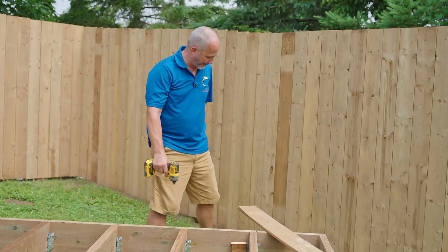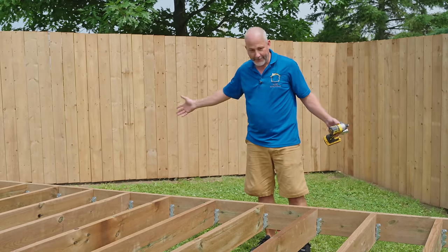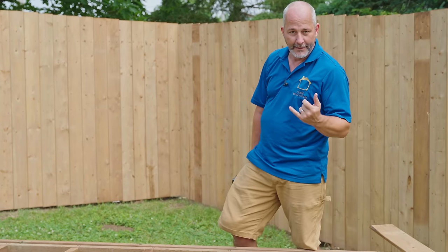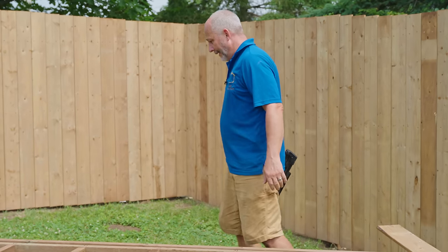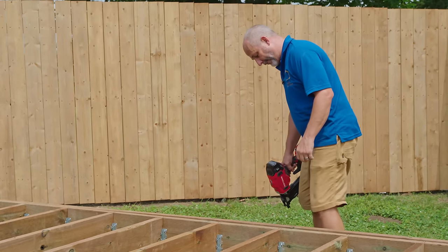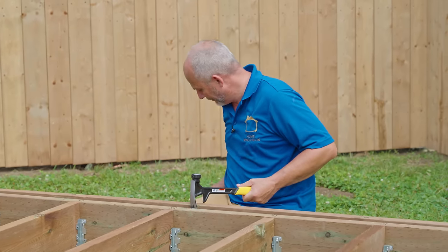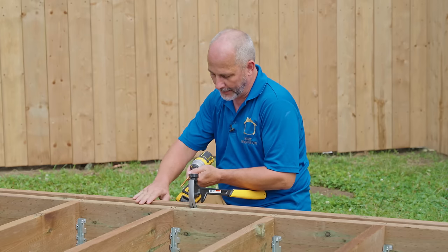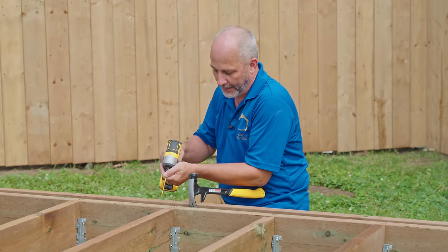Every time we add another layer to the structure everything tightens up. We'll get the double-up on the rim joist first, then finish our bracing, then start the plywood. Same rule applies — four nails for every joist — but instead of nailing where the joists are we're going to offset them so we're not hitting the other fasteners. This one has a lot of crown — as I tack both ends, I've got to force this one down. I'll create a bit of a gap so I can get a finger in and set up my screw. I need it to close about half an inch, so if the gap is half an inch I need to put the screw on a 45-degree angle.